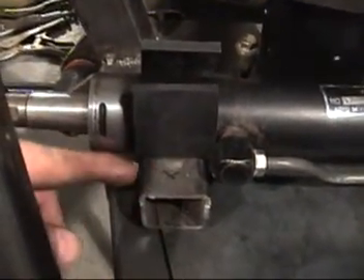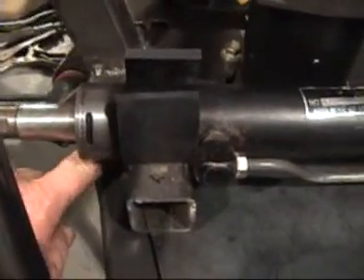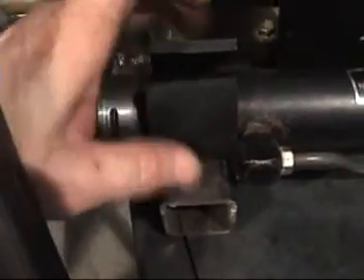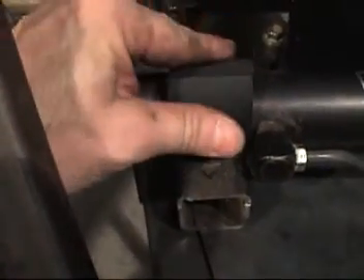I'm going to put a little plate in here so that it doesn't sit just on these edges — I'm going to have a little plate so that it's a complete saddle. I'm going to bring this over the top, cut a little bit more of this out. I'm going to drill a hole in here and here and weld a nut on the back side of each one of these, and bring my strap across the top.